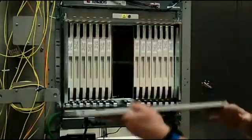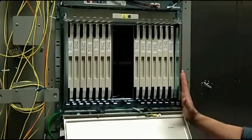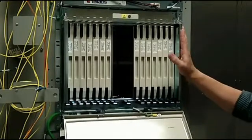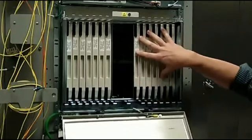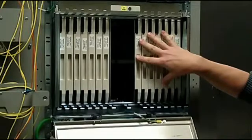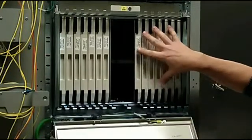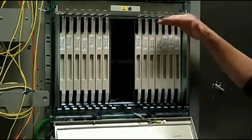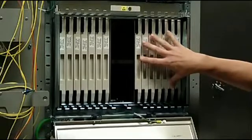After the 1150 shelf is connected with all the wiring, you just want to make sure that there's no damage to the shelf. These come with dummy cards, and the dummy cards will be removed as you start installing cards. This allows air to flow inside the system and keep the electronics cool.